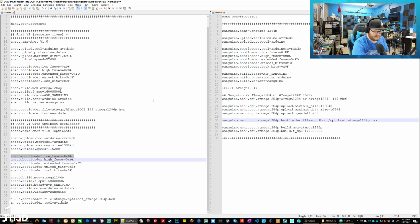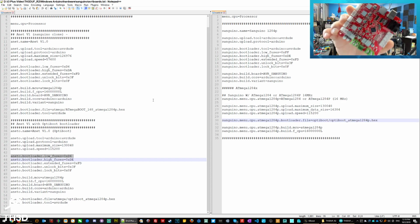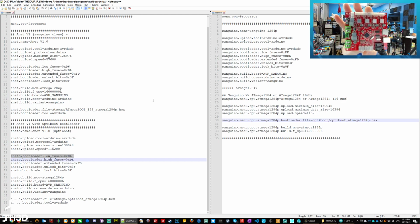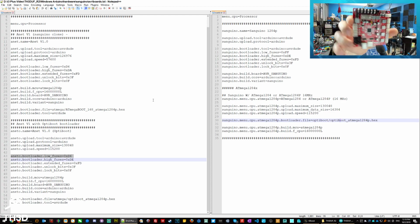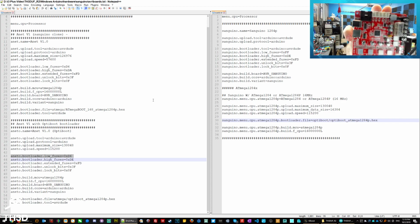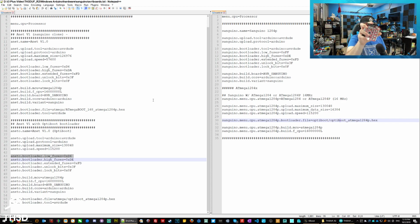You know, I have the Anet 1.5 sitting here. This is their older one that you guys are used to seeing, and I also have their new 1.7, which does replace the 1.5. So if you have an Anet A8 and your board burns up, this is a lot nicer board. They added a fuse, beefier terminals. I'm actually pretty impressed with this board. It's still a 1284p. They're okay chips, you know, they get the job done, but this is a lot nicer designed board. They've got a fuse here.